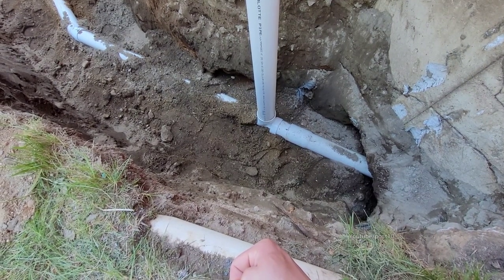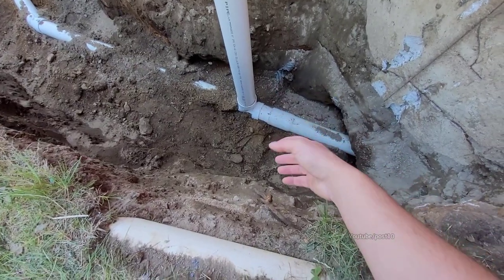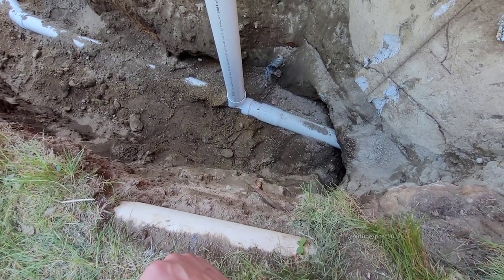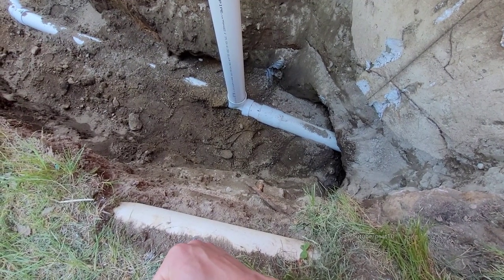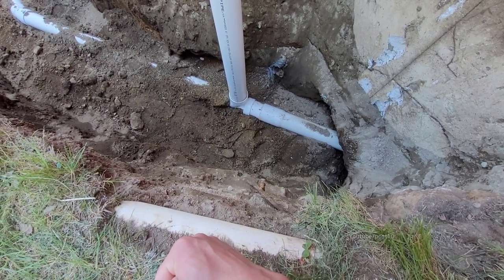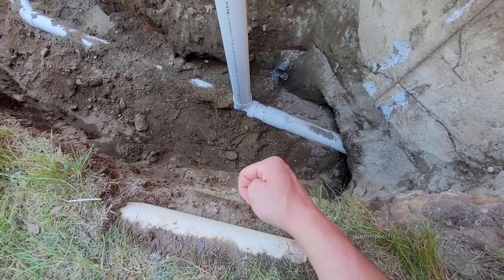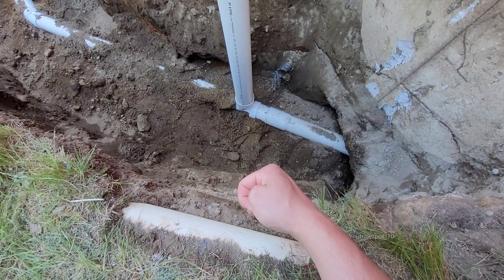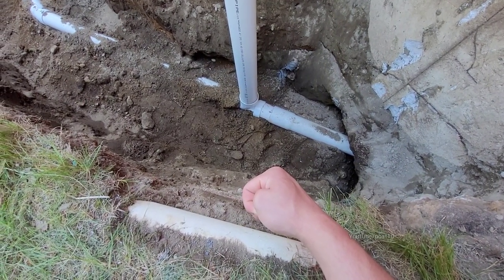Because I know in the winter time, I could come out here and I could dig 2 feet. This is a 4-foot trench. If I dug 2 feet in the springtime, it would fill with water. The water table around that time of year is definitely above the basement floor, and this just takes away lots of worries. Anyways, I was talking about, I went through the paperwork that was left in the house, like the old file cabinets, as I was throwing everything away.